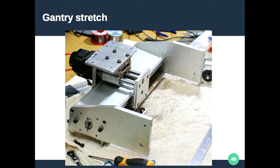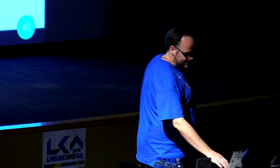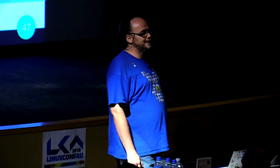Eventually you come to the point where you rip the gantry off. The two side parts of the gantry are half-inch aluminium, which is actually fairly beefy even though you can see gantry flex when drilling M6 holes. It looks surprisingly clean in that shot — the other part I haven't vacuumed yet. The machine has been running a number of jobs and the lead screws still aren't gunked up despite no vinyl accordion covers on the Z axis. It's a design deficiency but not one that bites you immediately.